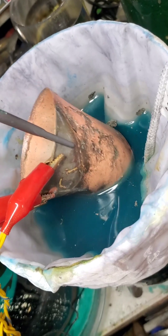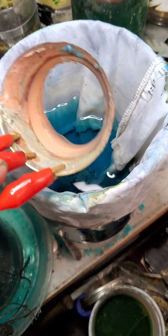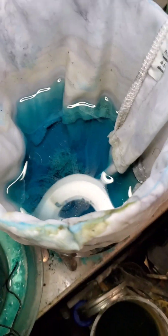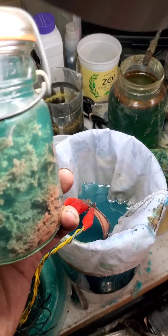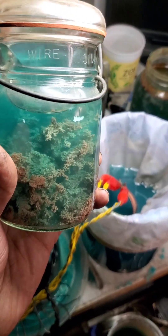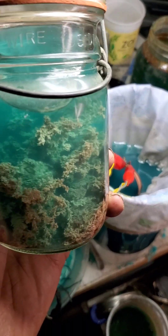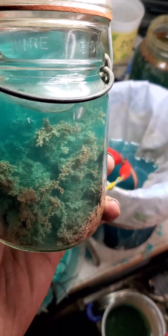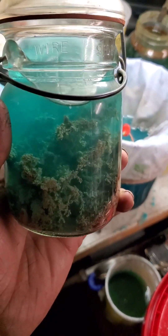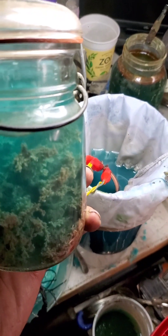That silver flake will just get stuck in the filter basket until there's no goblet left. So I need to clean the copper out of this cell before I continue dissolving the cup. I cleaned out the cell — here's some of our copper product. I'm going to keep collecting the copper so we can weigh it out at the end and see how much was recovered versus whatever's in the filter bag. I'll settle the solution to make sure I get all the solids out, dry them, and see what the results are.